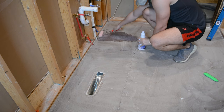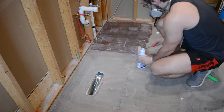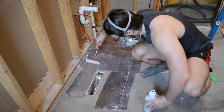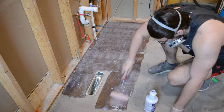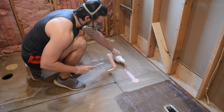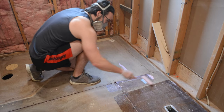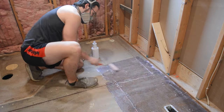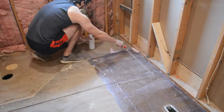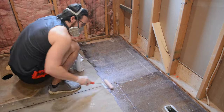This went on pretty easy — it's a little thicker than paint but rolls real nice. It's key that you wiped your floors down nicely, otherwise this won't stick. As long as your floors are clean it'll adhere nicely to your subfloor. This stuff dries pretty quickly, so you don't want to back-roll too much. Work quickly, and if you've already done an area and it's been a while, don't go back over it or it's going to gum up your roller.